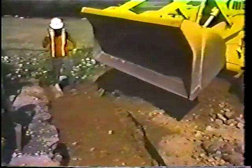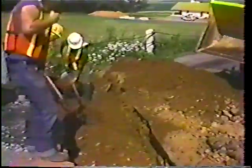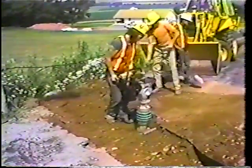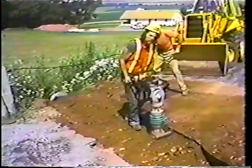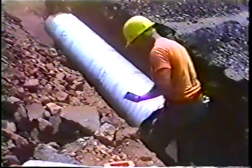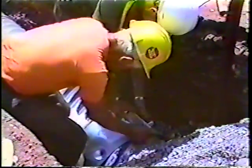The excavation is refilled using compacted earth, 3 to 5 inch lifts, until it approaches very close to the original subbase level. Note, subbase level and not the level of the wearing course. Then the same procedure is repeated. You now have 2 pieces of pipe in that are not, unless we've done something that I haven't mentioned, joined together. For this you will need a pipe clamp. This is merely a metal sleeve-like device that fits around the pipe in much the same manner as a collar fits on a shirt.